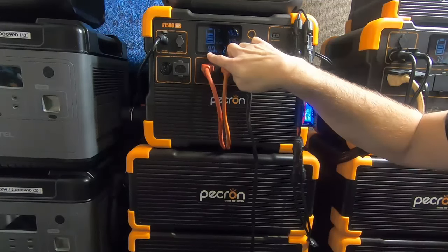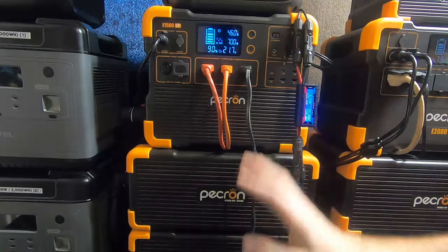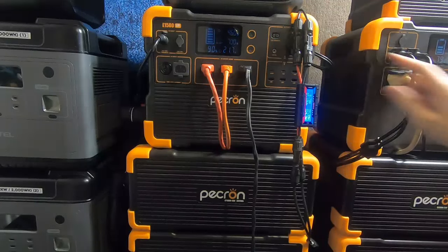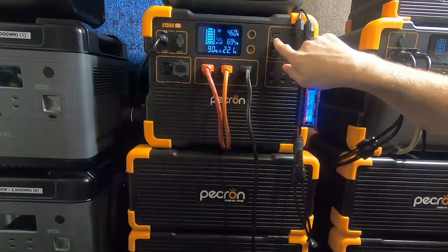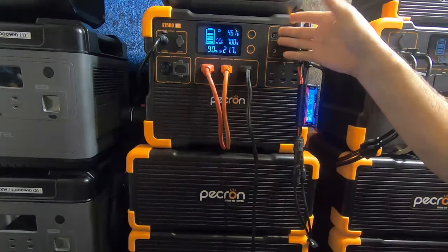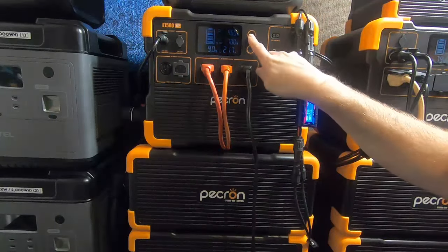As mentioned, you save almost 400 watt-hours a day by not having the app on. I've run it in UPS mode, with the app on and without, just to see the standby energy draw — it pulls about 10 to 15 watts per hour. I also wish this system had more outlets. I haven't been able to fully test the 30-amp output yet — I wanted to get a diesel heater but haven't picked one up. I've been able to pull about 14 amps at 12 volts out of the DC port so far.